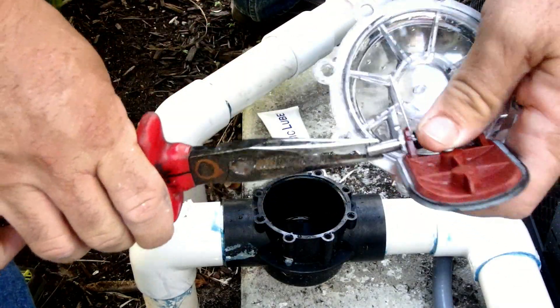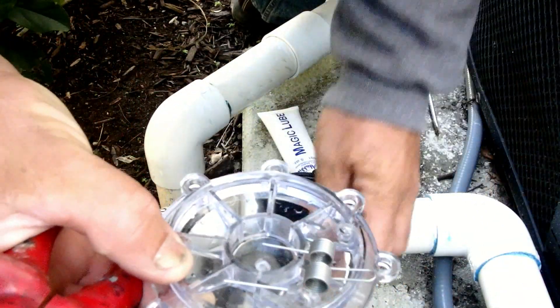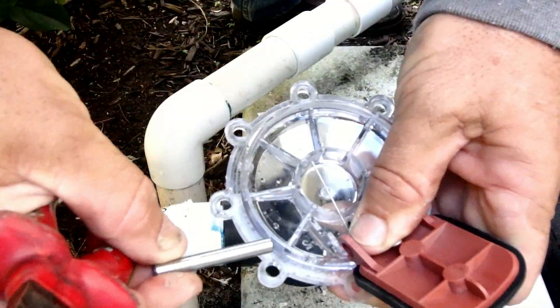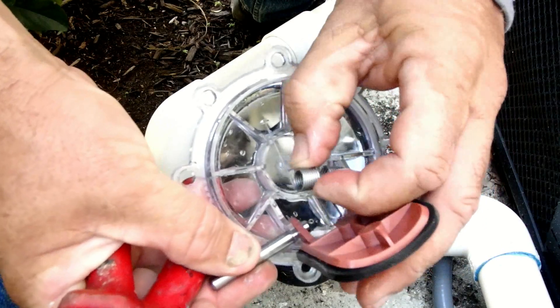It has wound up just a quarter turn. You have to look at the way it sits with most of the spring body facing towards you. Needle-nose pliers work best to push the pin out enough to grab it from the other side while you keep your thumb on the spring. Get the new flapper and line up the holes with the spring and squeeze in the pin until it pokes out the other side.